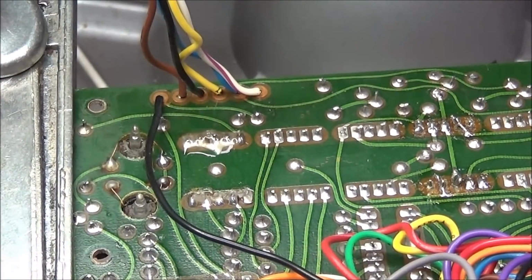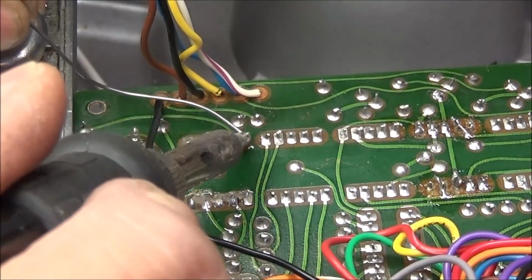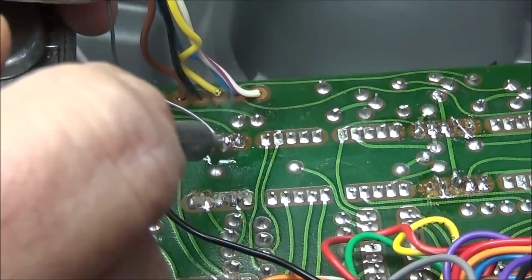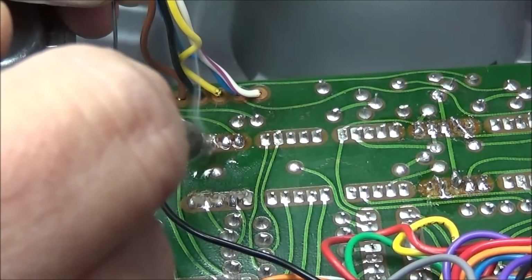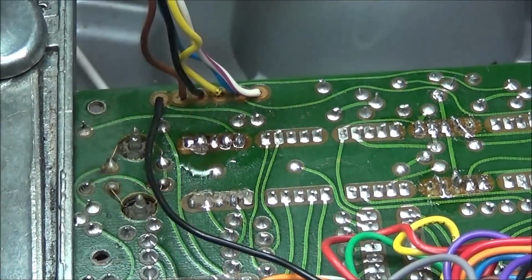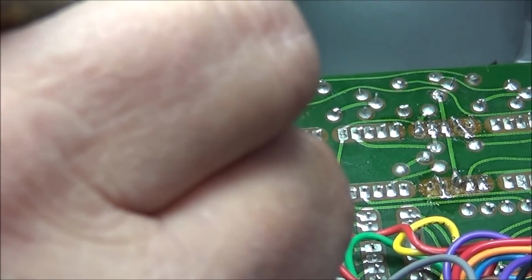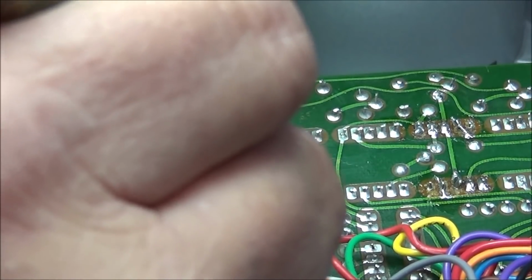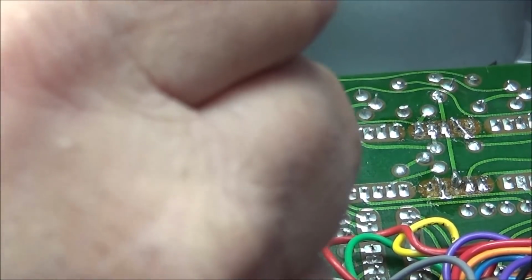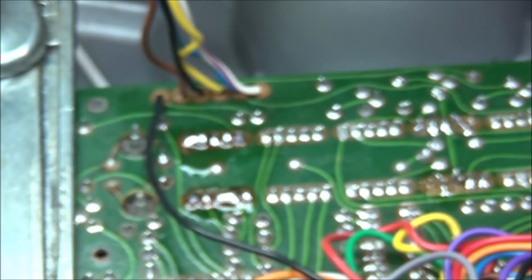And what I like to do, after I have applied flux, is go ahead and reflow with fresh solder on all the pads. Again, remember to keep your temperature down low so that you don't lift any traces up with heat. Like I say, this board is old. I think this frequency counter was around the 80s. You don't worry about bridging anything when you're going to remove them.